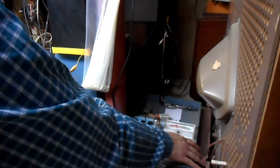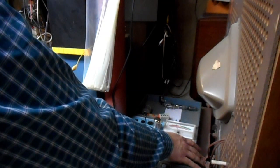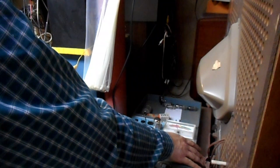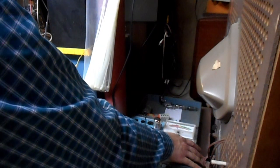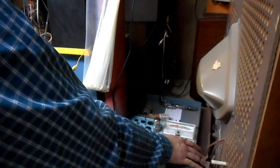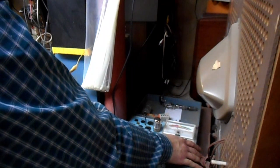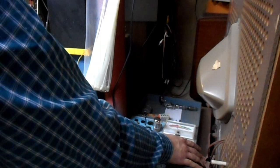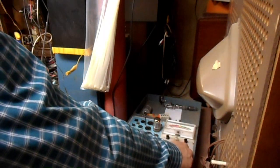I think this is the output section based on the A being set to 30 instead of being set to 95. Normally, more sane middle-of-the-road values are used on amplifier tubes, and the high value, like 95, is used for Zenith's buzz-o-matic detector stage, which is the other section of the tube that I haven't tested yet. So the output on this tube is clearly pretty weak. It's not dead, and I've seen power output tubes that will produce usable audio output even when they're down to like 30 on the scale, which is lower than this one by a good margin. But it definitely wouldn't be having full audio performance like that.